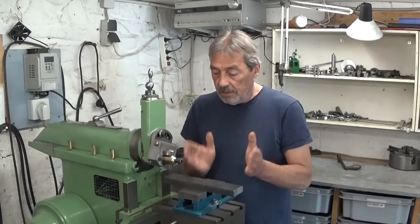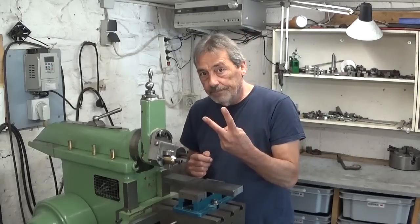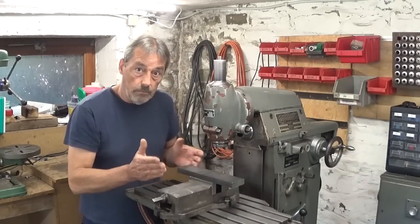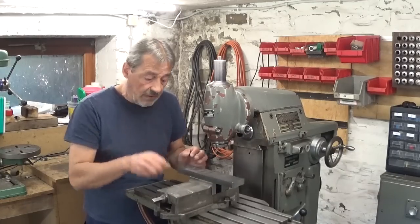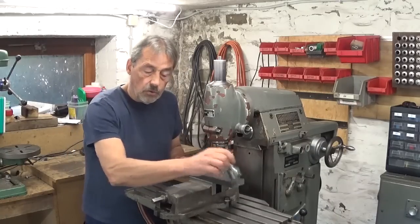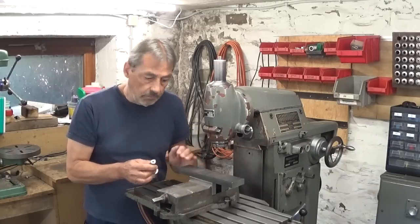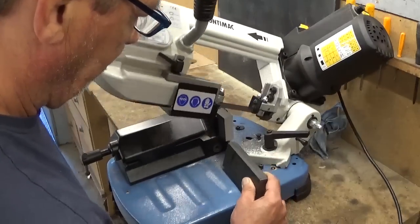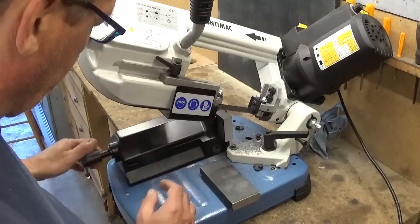So, if I want to use a shaper, I have to cut it in two and make it in 2 times. The total reach of the milling machine is 300 millimeters. So, in theory, here it could work. But I have to count also 2 times the cutter. So, in one part on the milling machine is not an option. I have to cut it in two. A good thing I didn't take my bandsaw machine apart yet.